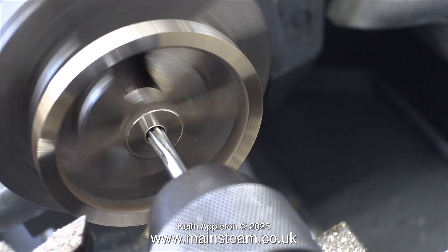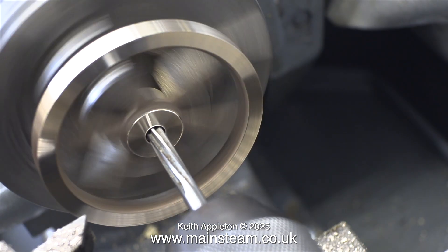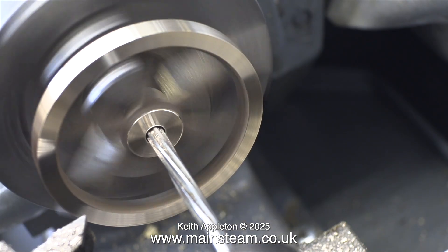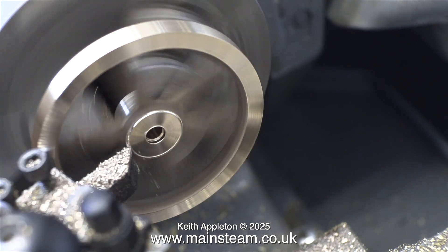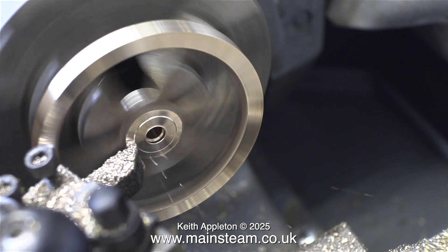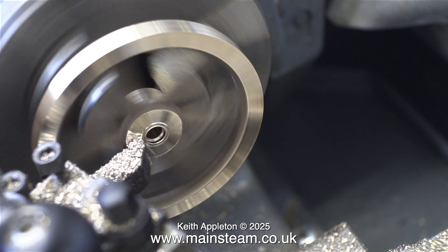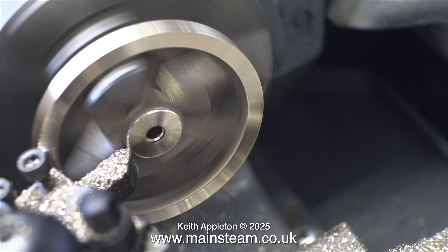In this clip I'm using a 7/32 of an inch diameter reamer, although currently the crankshaft is a little bit bigger than 7/32 of an inch — in the next episode I'll sort that out. Now I need to remove most of this boss on the outer part of the flywheel, because I need a small amount of the crankshaft to stick out of this centre hole on the outside.